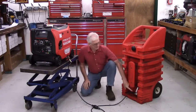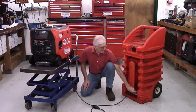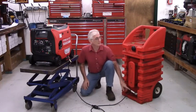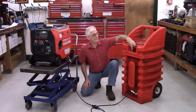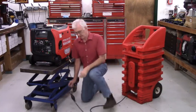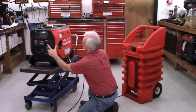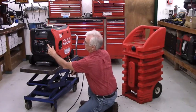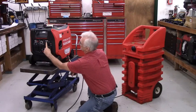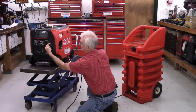If your fuel tank has a manual shutoff valve, go ahead and turn the manual valve to the on position. If your generator has a manual fuel tank vent, make sure that the fuel tank vent is in the open position. On the front of this generator you'll notice that the fuel selector valve has three positions: a propane position, an off/storage position, and a gasoline position.